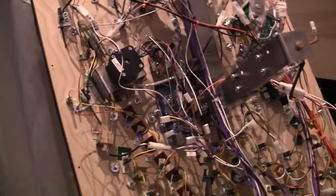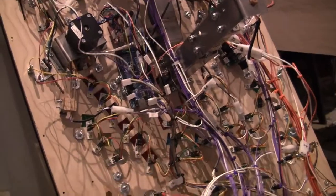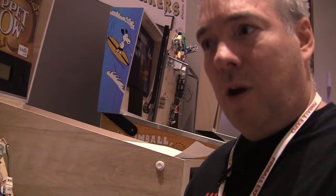In terms of layout, once you get everything set, it's about how you actually route it underneath the playfield and how you bundle the wires together to make them go where they need to go. The one rule we have with the Fast hardware is that the coil drivers and the switches controlling those drivers — it's beneficial to put them on the same board, because then you can completely auto-fire. If you're doing it through software like the Mission framework looking at switches and firing coils, it doesn't matter where things are. But for auto-fire coils — pop bumpers and slingshots — you want that switch and that coil on the same board. Even a strange mode where a flipper button might control a pop bumper could benefit from having them on the same driver board, using hardware control instead of a round trip to the host computer.